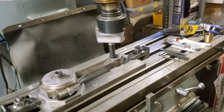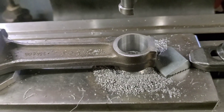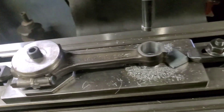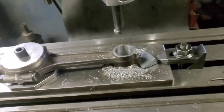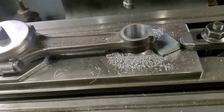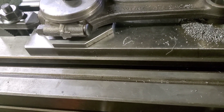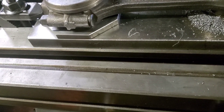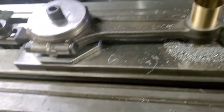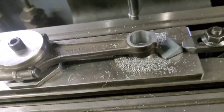I'm going to finish boring this and I'll be back. There we have it — got about one and a half thousandths press, one and six tenths. There's our bushing, just sits right down there on top. We've got a little chamfer on our bushing. I'm going to chamfer the rod — ready to press that in.